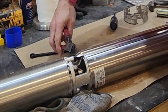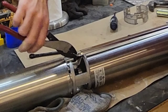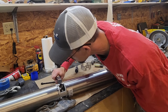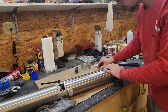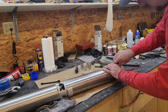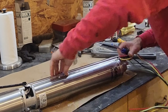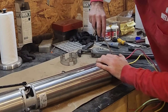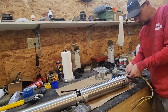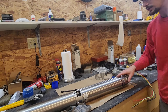I see down here that's catching, so we're going to go ahead and bend this up so it goes away from that. Tap that back down. Now we're going to reinsert our screws — the wire guard will be on. Okay, got that screw in. Wires are nice and straight, no pinches, no bulges, because you don't want that bulged up or the wire will be pinched under that.